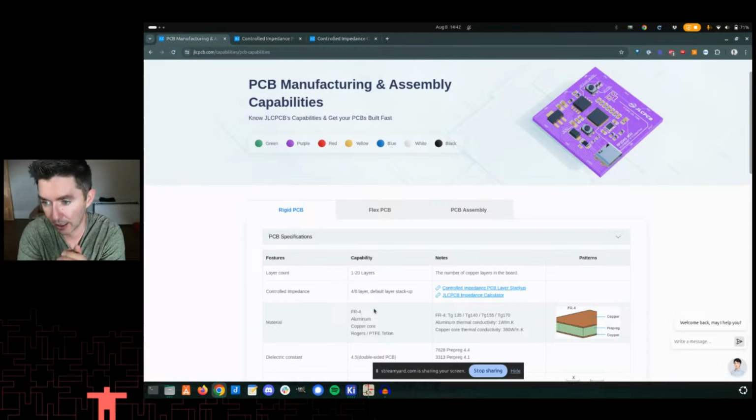That's ultimately what sets it up. So if you've ever cut a coax cable from the cable company in half, usually there's a copper conductor in the middle, and then a bunch of white stuff, which is really dielectric around it, and then a ground sheath running all the way back. That's ultimately what sets up that characteristic impedance. That's how they're able to send the signal so far without losses. Well, there are still some losses, but with minimal losses. And that's kind of what we're doing here.